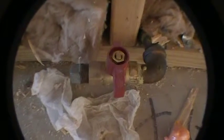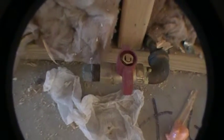One thing is you've got the gas shut-off valve right there. Okay, so that's for later on. We'll hook up the gas to that. This here is electrical connections. The big one is actually a standard 220 line that we run for all homes, just in case you wanted to switch back to electric someday. And then the other one is just a plug. That right there is all your under cabinet lighting, gets all junctioned together in that spot there, so it's easy to access behind the range rather than busting open the wall.